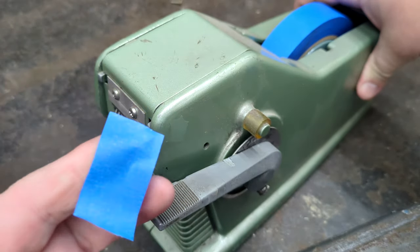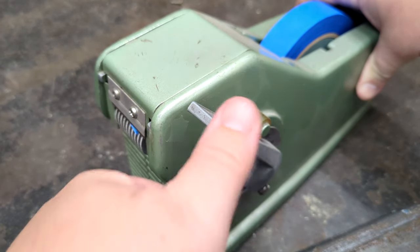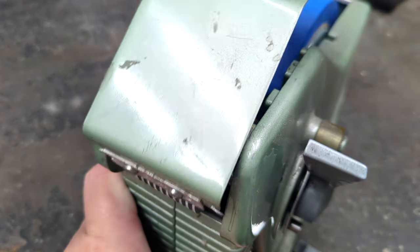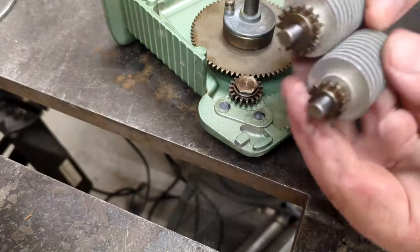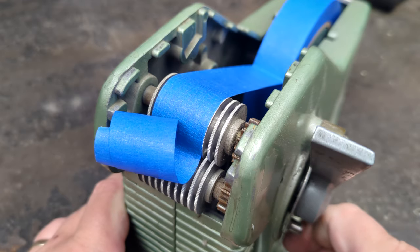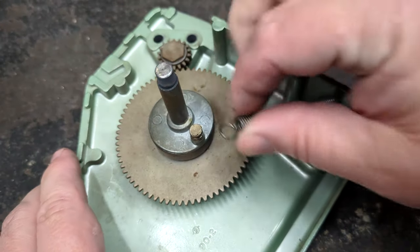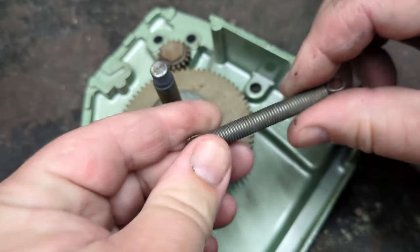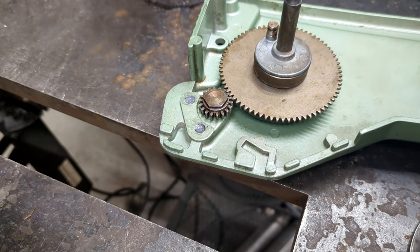Problem 1: the lever didn't always return all the way up, particularly on shorter strokes. I figured either the mechanism needed cleaning or the spring had gotten pulled out of shape, so I took it apart. With it open, you can see the business end more clearly. When I first got it, I expected the tape to come out from between two rollers, but that isn't how it works. They aren't counter-rotating, they're co-rotating, both driven by the same gear but with different ratios. The tape comes down over the top roller, but the lower one is rotating a bit faster. The tape can't stick to both of them at the same time, so it gets kicked out at the transition point. The spring looked fine, so I cleaned the mechanism — the 50-year-old grease was noticeably tacky, and the motion was quite stiff. A good lube job had it working again.